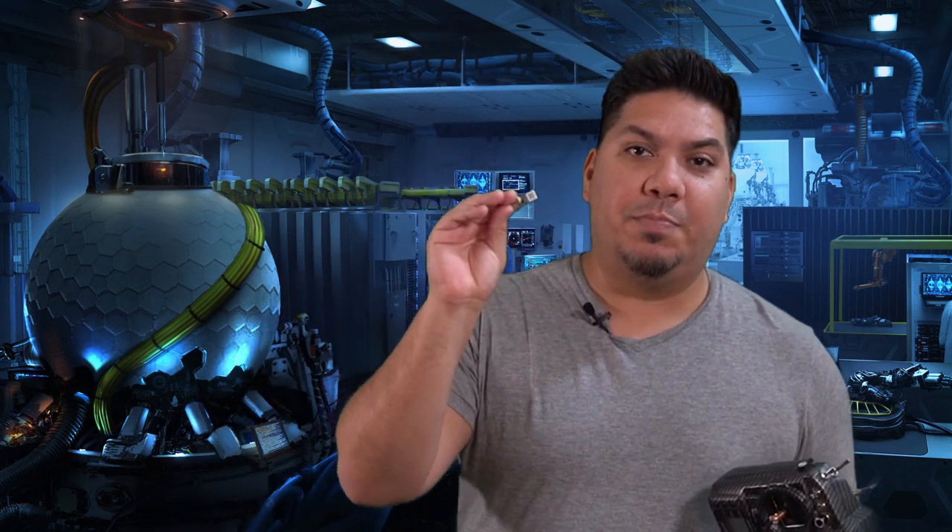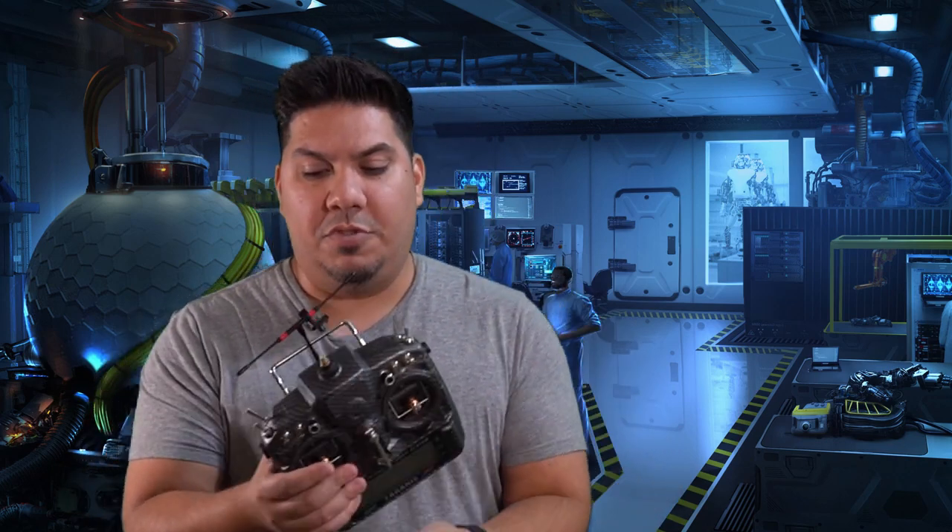By default, all three of these radios use a 2.4 gigahertz transmission system. With this receiver they use a protocol called SBUS — that's FrSky's protocol. There are other protocols out there: Spektrum, iBUS which is FlySky, and a couple of other options in the 900 megahertz range.